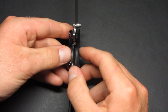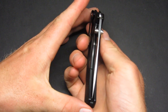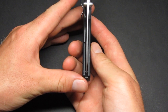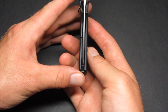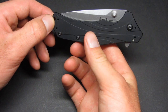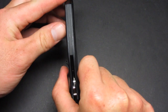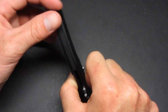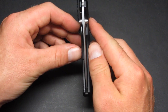When I first got this knife the blade centering was off, but I was able to take the knife apart, do some adjustments, and get it pretty much exactly centered. I did that by removing the scales, loosening the two screws to allow slight movement, and adjusting the pivot screw just a little bit — the back spacer is still flush with both sides of the handle.